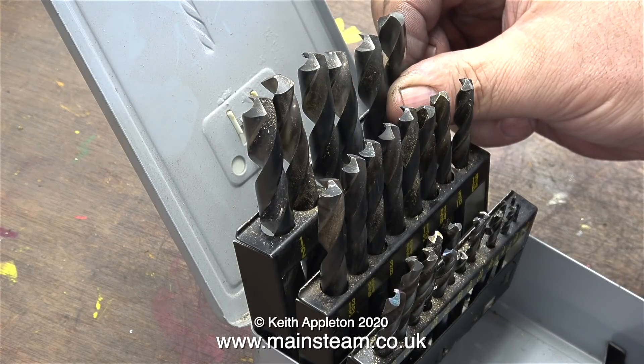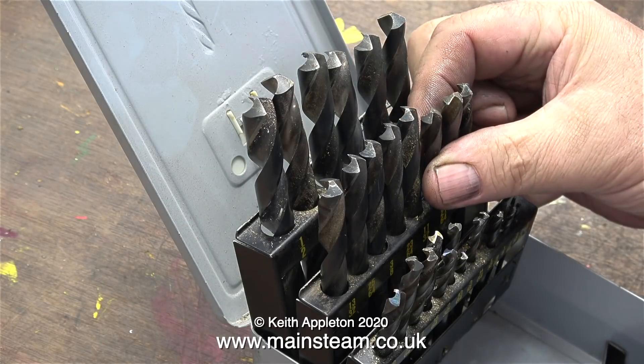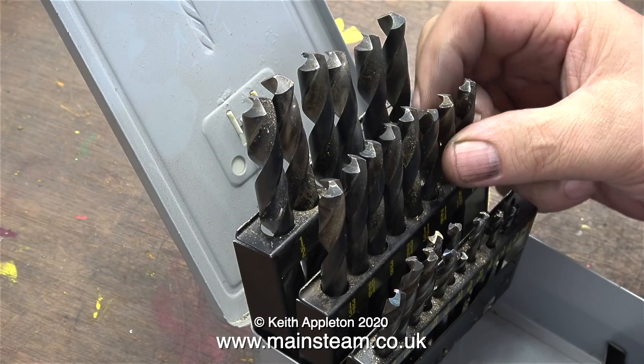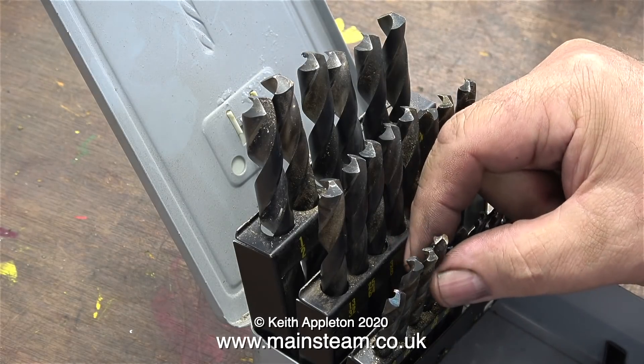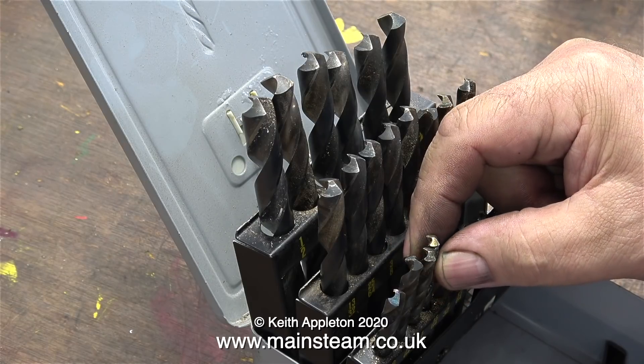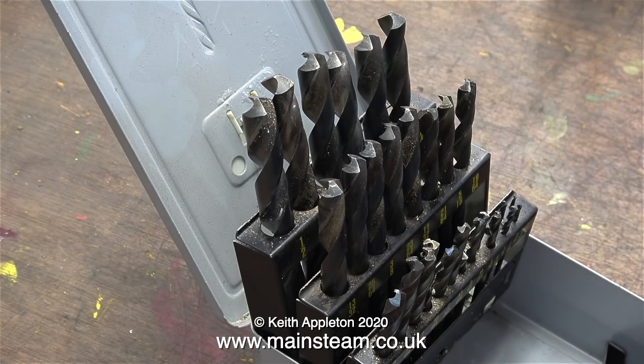How do you sharpen them? You could buy a special tool called a twist drill grinding jig, either a self-powered one or one that fastens to your grinding wheel. Alternatively, you could spend some time with some old twist drills, reducing them to much shorter twist drills. Here's a good tip — this is the way I do it: I always have a known good twist drill in close proximity to the grinding wheel, usually on the bench, so I can see it very clearly.